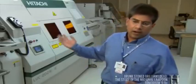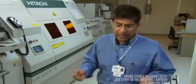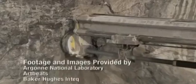Today we are laser drilling 100 to 125 microns, so we're about the width of a human hair. So just looking at it, you can't see it. You've got to have very high-powered microscopes to see it. We're talking about going below the human hair. We're going to be going to 50 to 75 microns. And as we embark on the nanotechnology age, we can only guess at the tiny dimensions laser-drilled holes will assume. No matter the size of the hole, drilling has shaped, or rather reshaped, our world by opening innumerable portals for mankind.